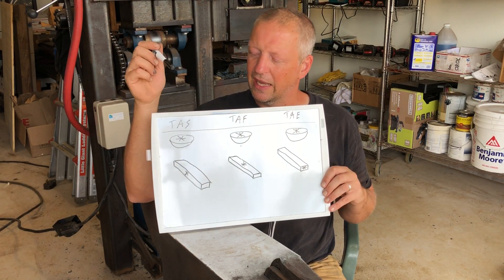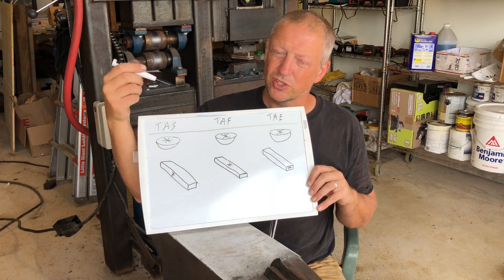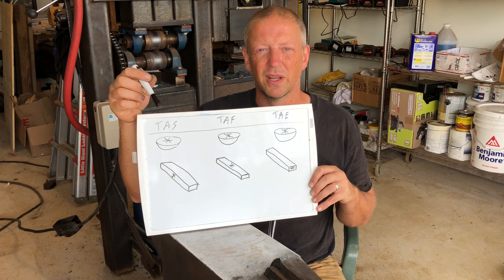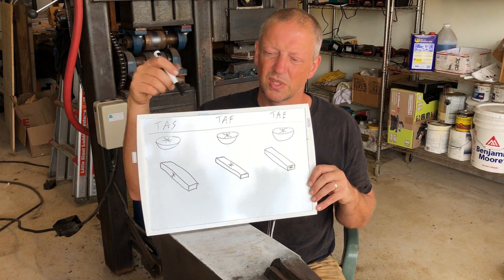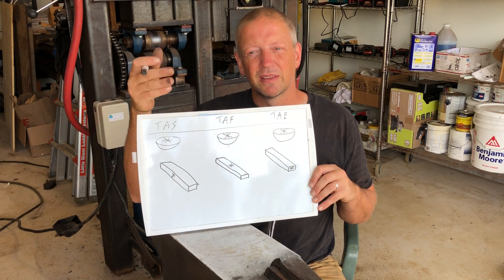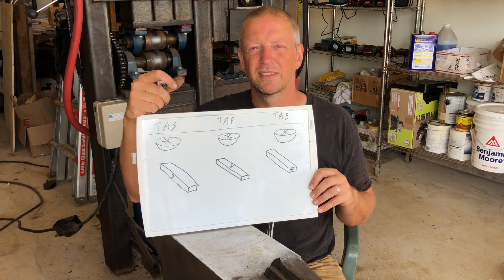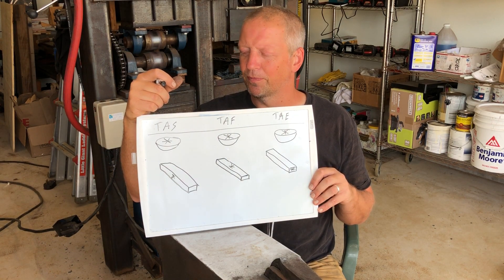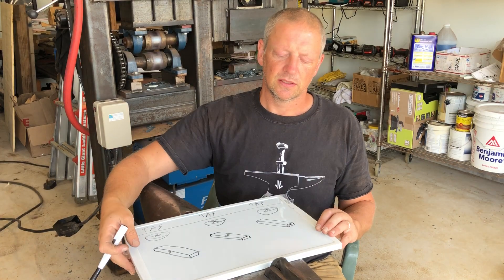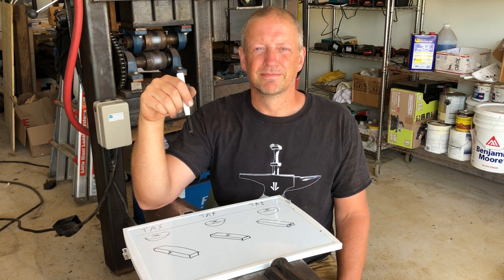For both top as spine and top as face, your very first step is to set your ingot face down on the anvil. If you have tongs that hold around the edges, you've got that flat face down on your anvil and you can forge on the top and work it down into a disk, then decide which direction you're going to go. I've worked in all of these orientations and also done the donut technique. If you've got questions, ask them in the comments or find me on Instagram at Peter Burt Knives. Thanks for watching.